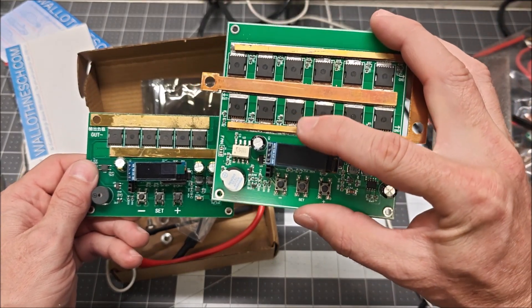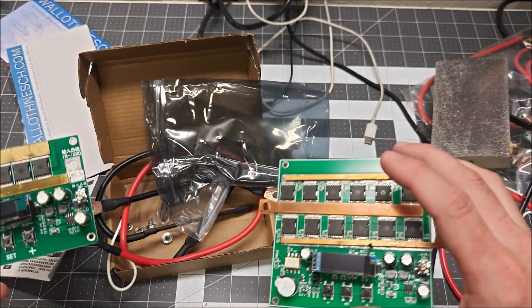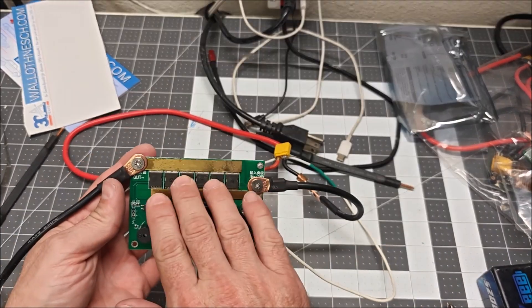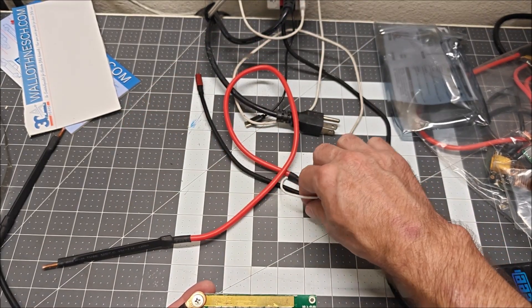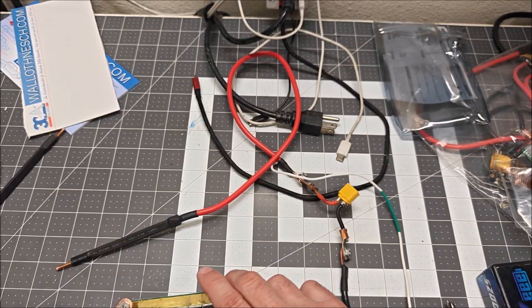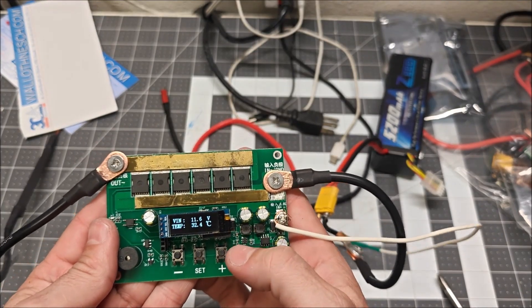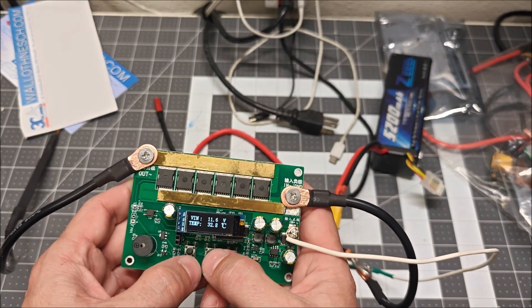The old one had a really weird interface, so we'll see if this one is the same. Let's set up the leads using the stock leads. The way this works is the MOSFETs break the negative — the positive comes straight from the battery with no electronics on it. There's an extra white wire feeding the electronics, but it only breaks the negative connection. The battery is only halfway charged but that's fine for testing.